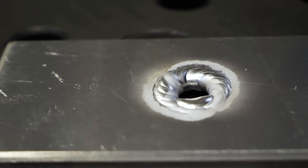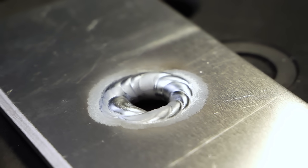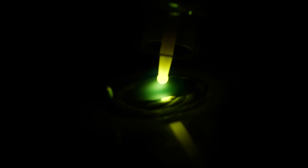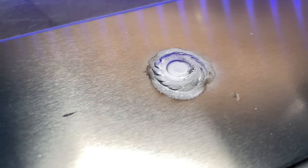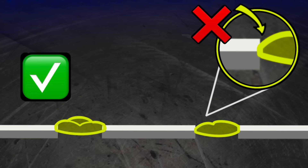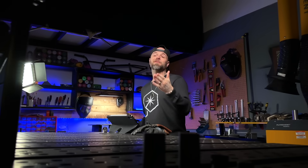We're going to focus on getting proper heat input into the workpiece on the other side after we flip it. When you're done both halves and finished going around the edge, it's going to look something like this — you can see we have welded around the edge all the way. Now we are going to get set up and fill the center. We're going to add a reasonable amount of heat input and use enough filler material as needed. After you're done, it's going to look something like this. We can see that it is all proud to the surface level of the base material, meaning there are no hollow or below-surface spots. This is very important. Now we're going to flip it over and weld the other side.